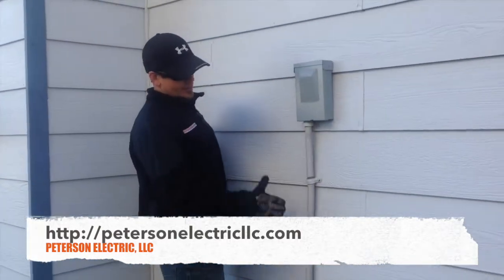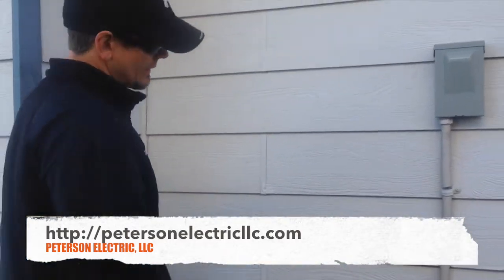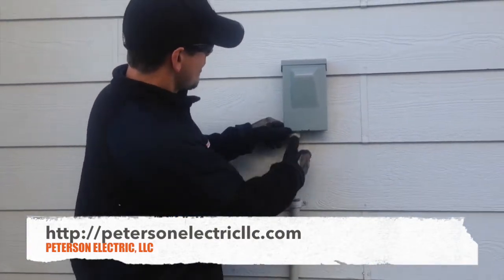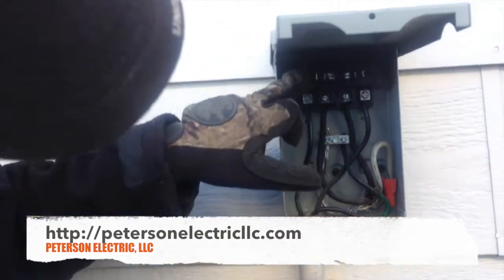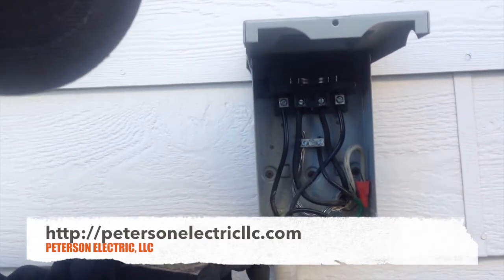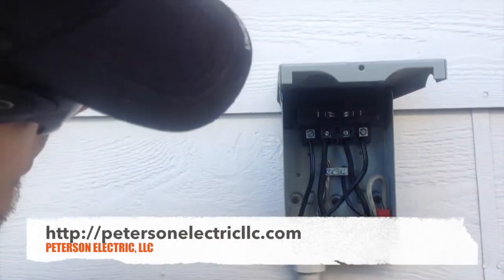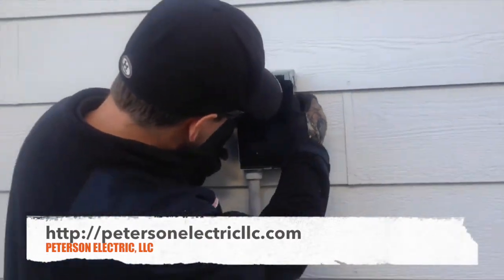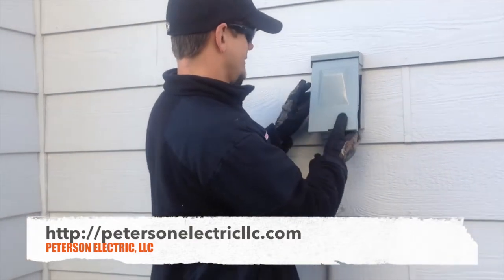This house is about 20 years old — technically you're supposed to have an outlet within a 25-foot radius as well, but they didn't. Anyway, in here this is a non-fusible disconnect. I take the cover off and there is no fuse — it's just a stab pull-out. It's single-phase, rated at 60 amps. The wiring in here is aluminum, number six, so it's probably actually rated closer to a number eight.